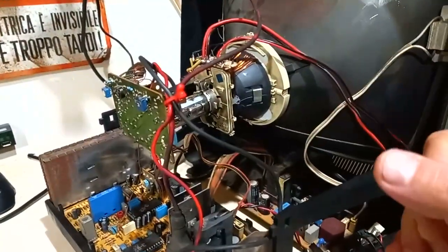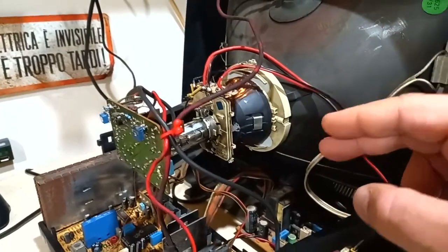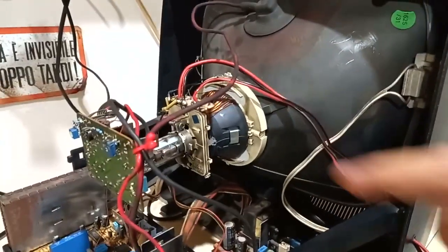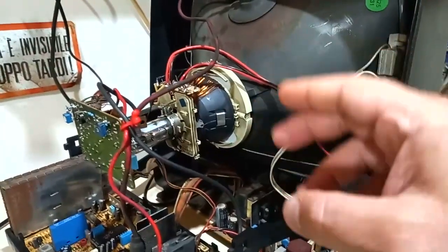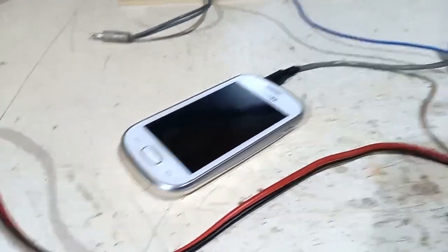The difference was that at that time the yoke was turned 90 degrees, to have the vertical deflection coil make the horizontal sweep with a triangular wave of just 50 Hz, provided through the power amplifier by a function generator. The horizontal deflection coil was instead the vertical, more sensitive to higher frequencies, and that coil was driven with a signal from the music of a smartphone. But now there are some differences.